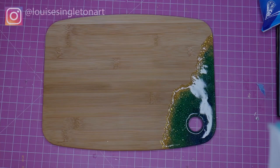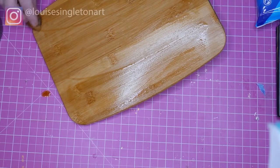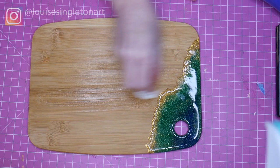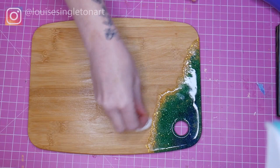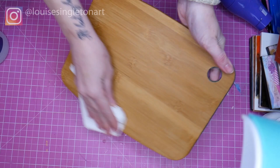I've taken off the masking now — you can see that mark from the latex is gone once it's all dried out. I'm just using a tea bag that I've had in some hot water and rubbing it all over the wood — it gives it a little bit of extra richness, it's a very subtle difference, but I just like to bring that little bit of extra colour to the wood in a way that's food safe without any chemicals. I'm going to use this wood oil and wax now, rubbing it in all over the wood — it nourishes it, gives it a lovely finish and protects it. This wood oil and wax is designed for worktops, serving boards and chopping boards, so it's perfectly safe. After an hour I'll wipe off all the excess and it will be finished.